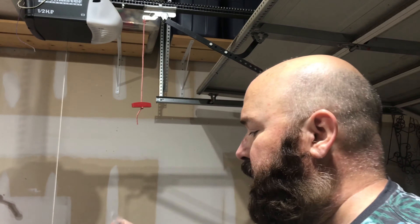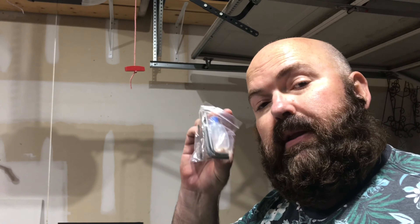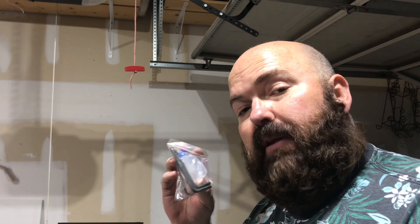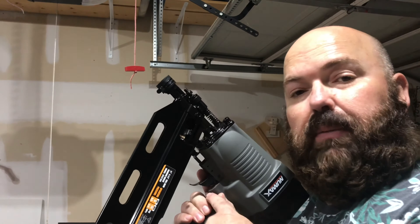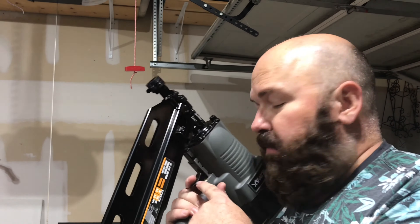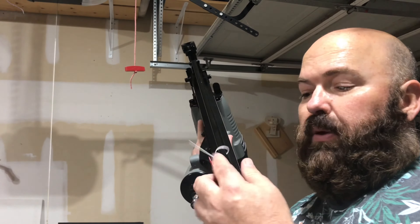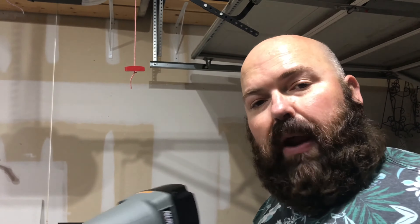The tool actually came with a little package with oil and all the allen wrenches you would need. My Craftsman tools didn't come with oil — for first use, this will get you started. It is shipped in single actuation mode, meaning you pull the trigger each time you want to fire. But it comes with another key that makes it contact actuation for rapid fire, so you can make contact and go faster.